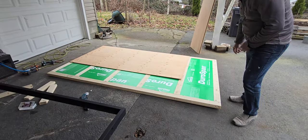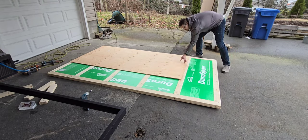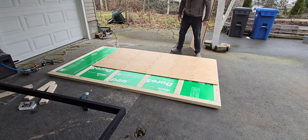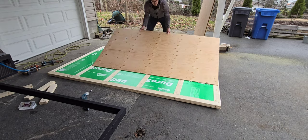I'm going to stagger these joints because on the other side I got the butt joint right there, and this one I'm going to run this way so there's a little bit more strength in that. Not that it needs it, but it doesn't hurt to have. So I'm going to get my pieces glued up and start nailing down.